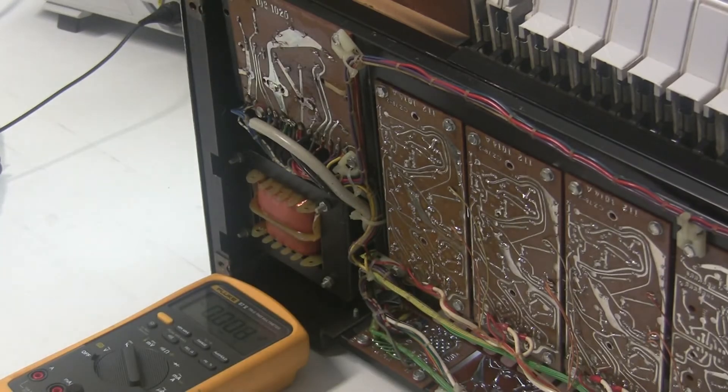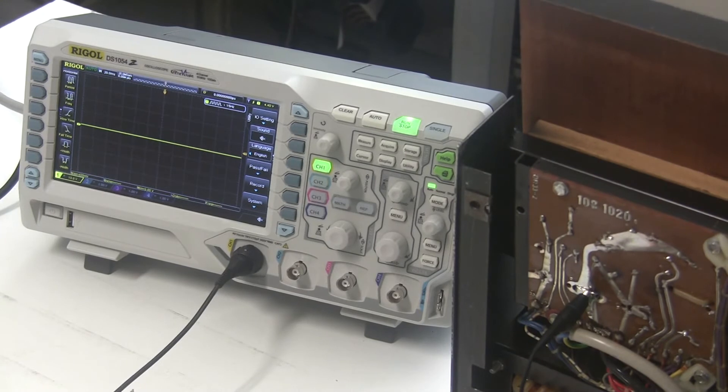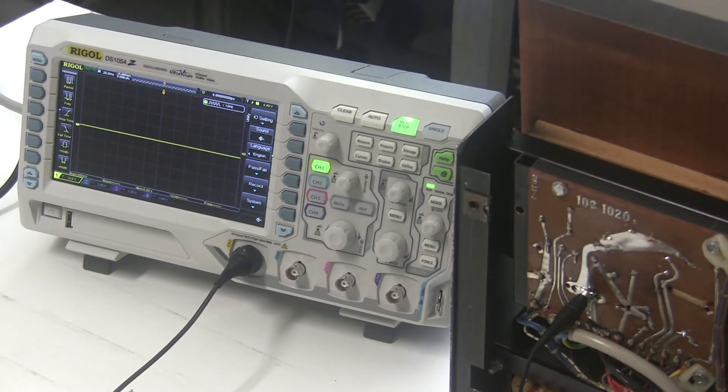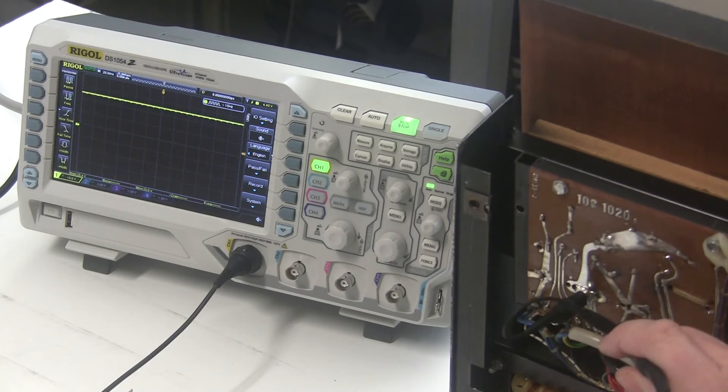The positive 25 volt rail measures 26 volts as expected. The 20 volt rail reads 26.05V, but that depends on there being an expression pedal with a lamp in it, so that one can't be relied on. The plus 15 volt rail is 15.77 volts, the plus 21 volt rail is 20.5 volts, the minus 9 is -8.59, and the minus 8 is -7.98. Things are fairly close to being in spec. I also want to show there's an AC component — ripple — to those readings.